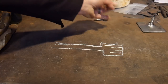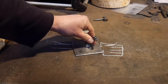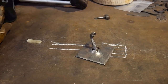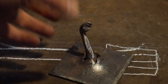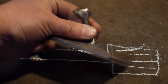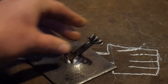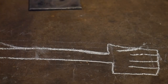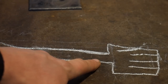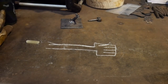Later on we will come back through and cut in the fingers to this hand. We'll have something that looks approximately like a hand on the end, and then we'll cut in the individual fingers and thumb and spread them out to where it actually looks like a little hand. There's a little bit of a trick to how that has to work. We're going to be doing this from a piece of quarter by one inch flat stock, or 25 mil by 6 mil flat stock. Leave it on a long bar so it's easier to work the end without tongs. So without further ado, let's get to it.